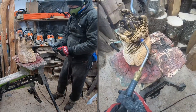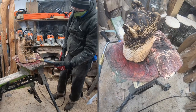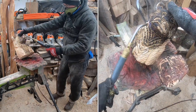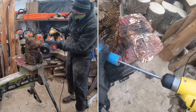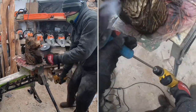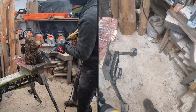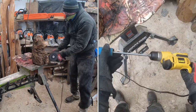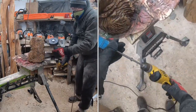Once sanded, take your torch and just burn everything thoroughly. This piece is frozen because it's freezing out — he still has quite a bit of moisture in him, so I've got to dry it out with the first burn, then go over it a second time. Once the burn reaches the desired color, take the Sandoflex again at not full speed and go through to remove the dark soot. You can Sandoflex once, get rid of all the fuzzies and paint black, or torch it again a second time, Sandoflex lightly, then paint the eyes and put a little black on the nose.